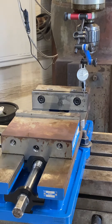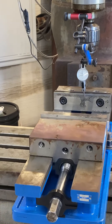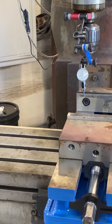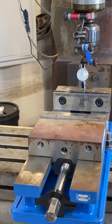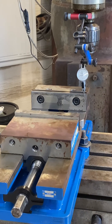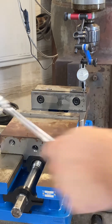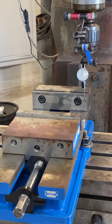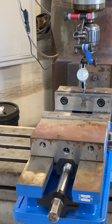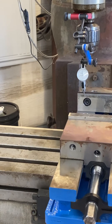I move about two thirds of the amount of that full travel, then I snug the bolts on the vise to the table — tight enough that it's not going to move too much. Then I travel again; when that needle jumps a little bit, that's the power feed engaging, which makes the needle jump just about a thousandth. I travel down and back and I can see I'm really really close — pretty much there. I tighten the table bolts down, then zero the indicator again so I know I'm exactly on zero. I run the travel all the way one way to verify it, and now my vise is indicated in.